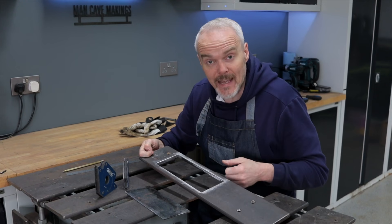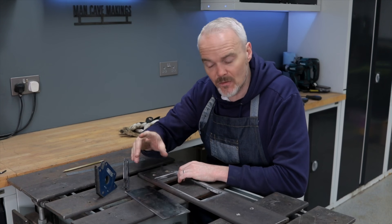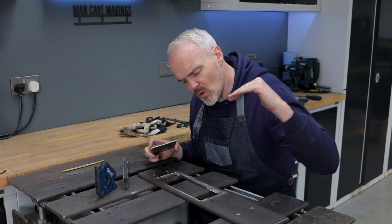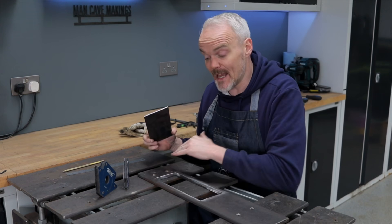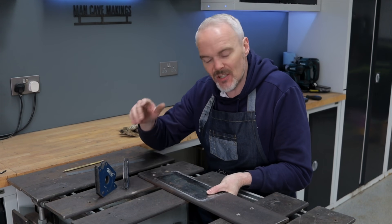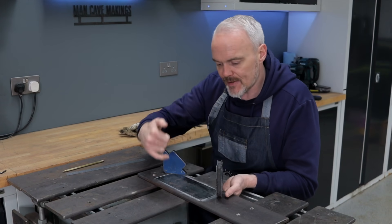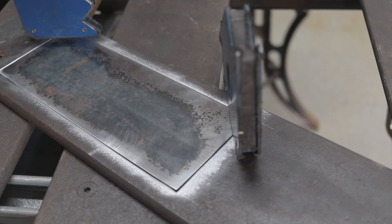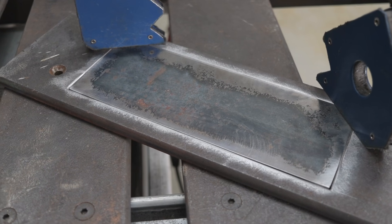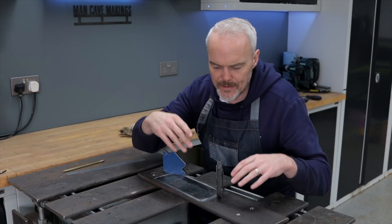I've created the aperture in the main plate now, ready for the thinner gauge material to get dropped in. I've created a quite steep angle bevel onto the edge here, and the reason for doing that is when this plate gets dropped in I'm just going to use these magnets to square things up, and then it creates that small line ready for my welding rod to get dripped into there.